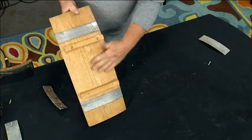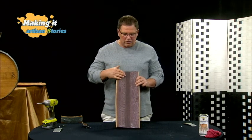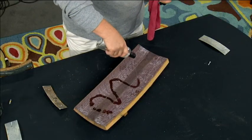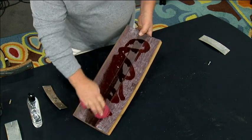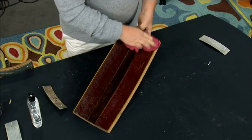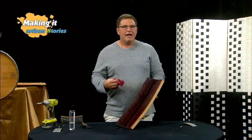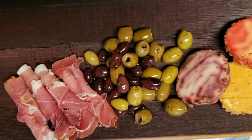This is natural. I had a challenge that this was going to be used for food, so I didn't want to put any kind of shellac or stain on it. So I had to think — what can I use that will protect the wood yet still look pretty? What I did was I got this butcher block oil, which is of course natural. I drizzle some on like that on every board, and you'll see the richness — how it's changing the color and just sucking right into the wood. It stays nice and shiny for a little while, and then eventually it'll get dull because the wood is going to draw it in. The way you clean these is really easy too. You don't put them in the dishwasher — you can't, because it is wood and you don't want to soak them. All you want to do is clean them off after you're done using them, and every couple of weeks go ahead and get your butcher block oil out and re-oil it. Put it aside — it's good for a couple of weeks after that.